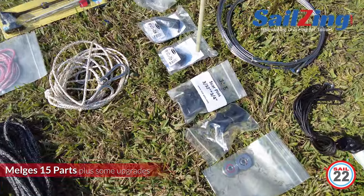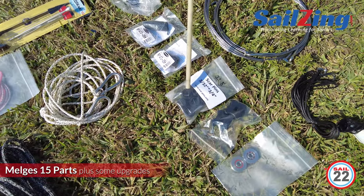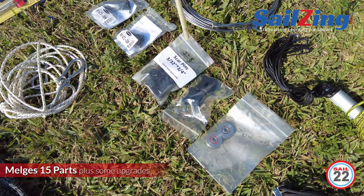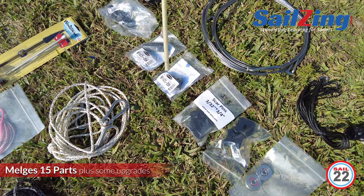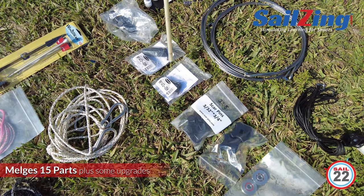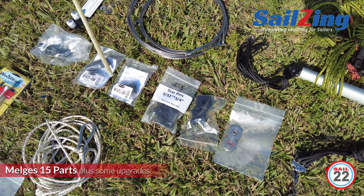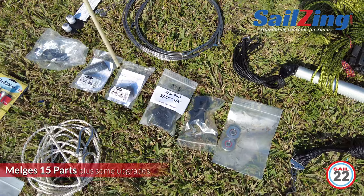So this is our system for tuning the rig. Scar pins will hold the rig in place, so once you put those on, you can't spin the rig. You only have to put them on the top because the bottom is attached. We have the star grips. They go onto the turnbuckle barrel so you can grab and turn very easily. And then this is what they call a handle from Ronstan. That goes on the wire, so you can hold the wire because you don't want the wire spinning, even by accident, because you can unwind it. So this whole system together is what we would use to tune the rig. No tools. I originally said hands-free, but you're going to need your hands. So that's a kind of cool system that we like.